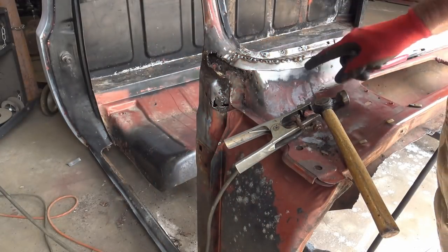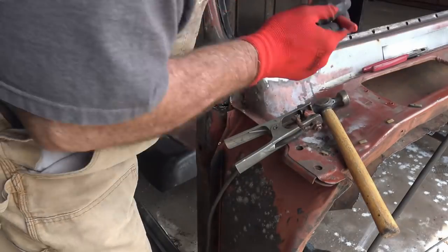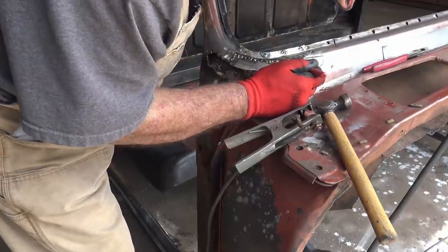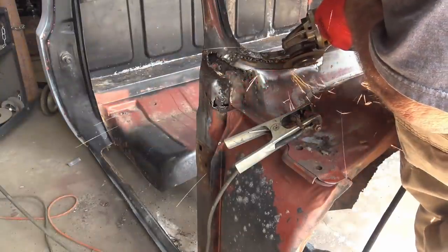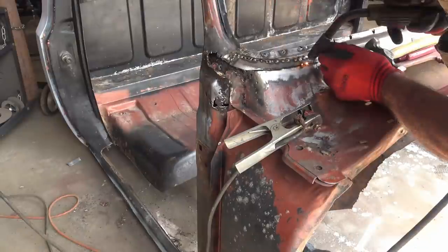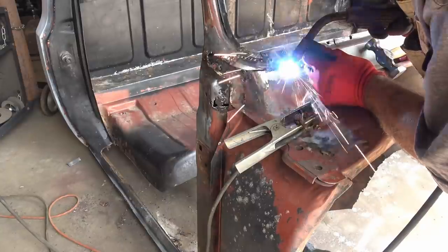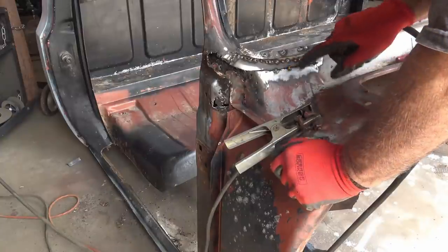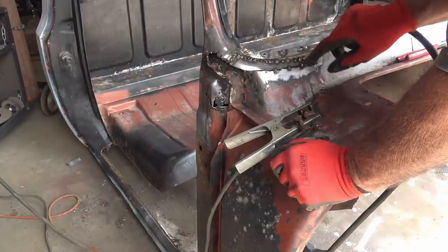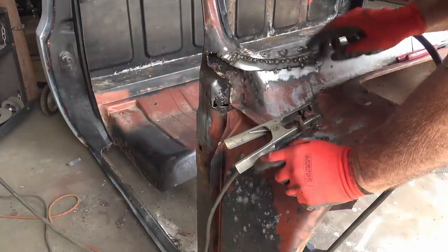Now I need to cut across the bottom, this end and the bottom, and get that fitting. And let's see, there was my mark on that end. So probably cut like down there. Yep, that'll work. I'm gonna weld this up, and it's gonna require this little quick burst of that MIG welder all the way, everywhere, to get that welded up. So when I get it welded up, I'll show you what that looks like, and I'll grind it down and show you what it looks like finished.